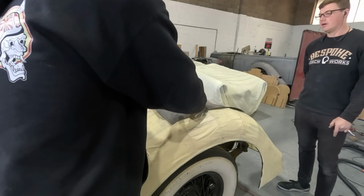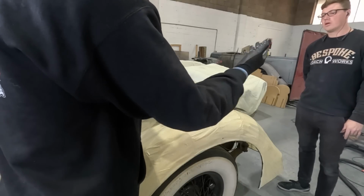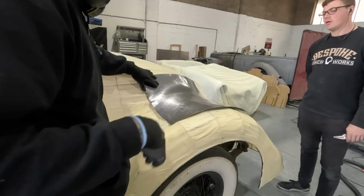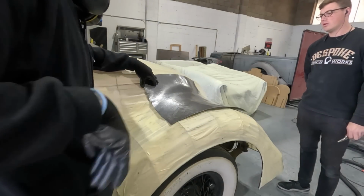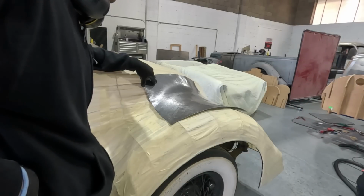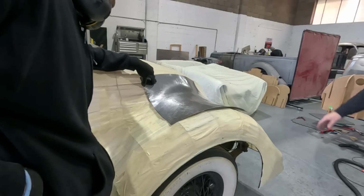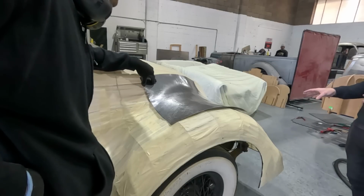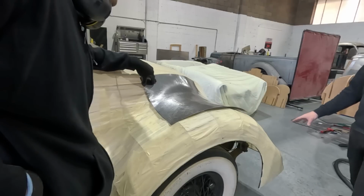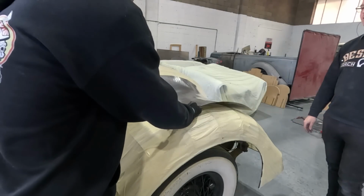This makes more sense to me because you're working an area, and it's not even deforming much. You work an area, it gets closer. It's not some wild out-of-form or out-of-arrangement situation. You can't really do reverses out of arrangement. Usually when you put a reverse in something, you do all your shrinking and smoothing before you've done the reverse, because once the reverse goes in, it locks in arrangement. So it's very hard to do something like that out of arrangement.